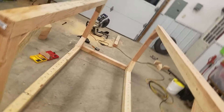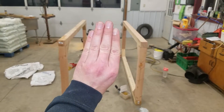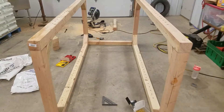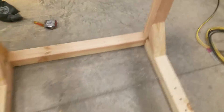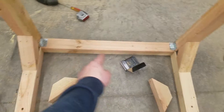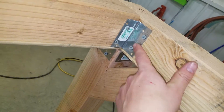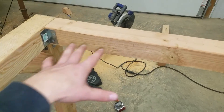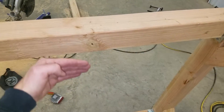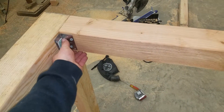I did the second one and I've stood them up on their sides. That would be the final position. I'm going to put it back upright, put a bracket here, a bracket here, and then put two of these 45s in. Then I should be able to stand it up. I've got the cross beam in place - this is going to be the back one, this is going to be the front one. These should be on this side because the weight is going to be pulling this way, so you want them more on this side - when you're pulling down this will help with the force.